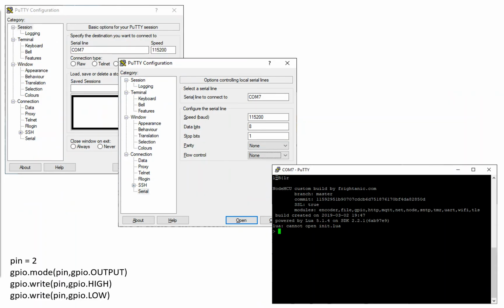So once we've got that, now we get to the good stuff. Our board is now flashed, and we can start to talk to it. We load up PuTTY and find out whichever COM port it's plugged into. At this point, we're on COM 7. We set our speed correctly, and it's important that we turn flow control off. What I'm going to do with this next video demonstration is copy and paste in pin = 2, gpio.mode(pin, gpio.OUTPUT) to say I'm going to send some data to it, not receive some data from it, and I'm going to set that pin to high. Guess what that's going to do?